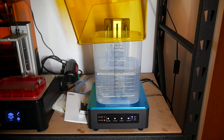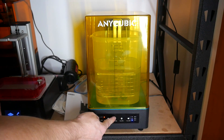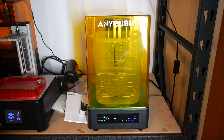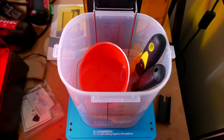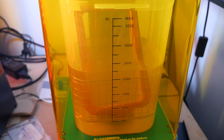On to testing this machine — by far my favourite method was to insert the entire build platform of the 3D printer inside the IPA container, suspended from the included metal bracket. I really felt like this cut down manual handling of the parts post-3D printing and pre-washing. Typically I went for a single 6-minute cycle, and I noticed that 3 minutes in, it would slow down and then the motor would reverse for the duration of the washing — a nice touch that probably helps it clean a bit more effectively. I also tested by manually placing parts into the basket, separate to the build platform, and also washed some of my tools to remove excess resin. When changing resins, I even tried washing the entire vat, which did save some time, but I still had to clean it manually afterwards.